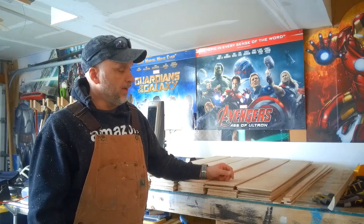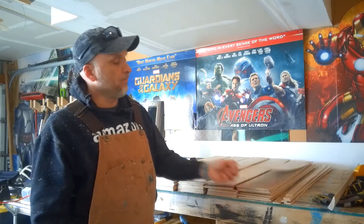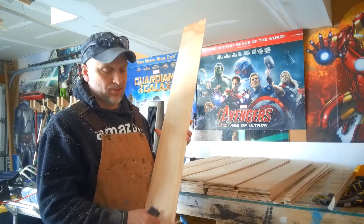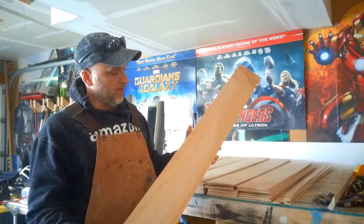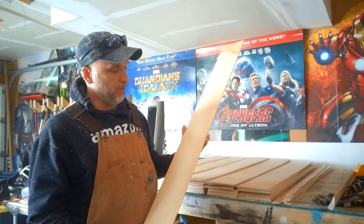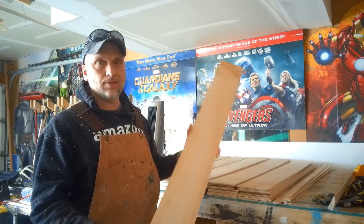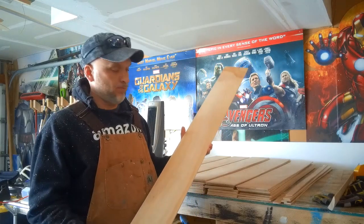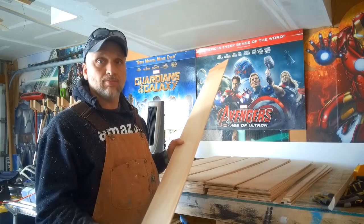I got another job with the same material coming up where we're going to lay in a horizontal fashion, just like shiplap. Now, one thing I did want to point out too is that in the past I've chamfered the edges, so it gives it more of that shiplap feel, but this stuff doesn't like to be routed, or I put it on the table saw and done a chamfer on it too, and it just doesn't react well to that. And you could still do it, but it's not really necessary. That's why I say I'm going to rough it up with the orbital sander around the edges, and it'll give it that great illusion of it being kind of thicker. But in this, once it's on the wall, you can't tell if it's 1/4 inch or 1 inch thick. So stay tuned and watch.